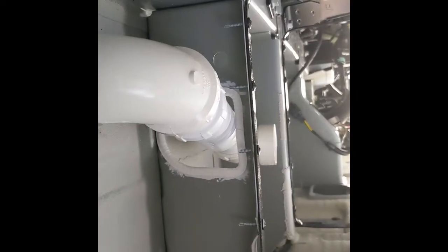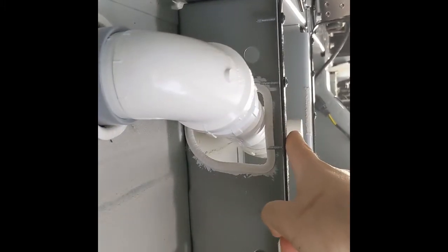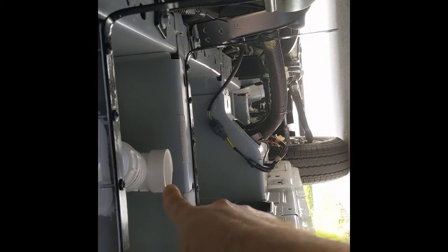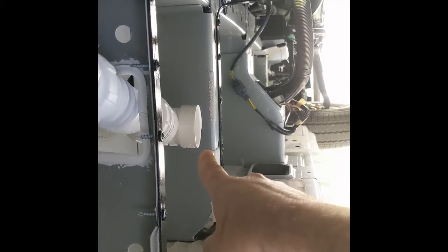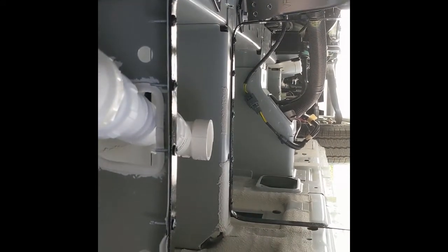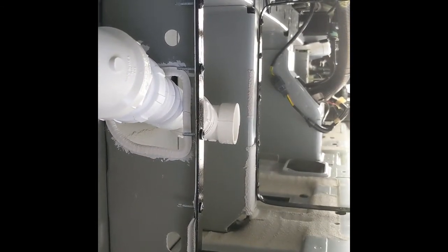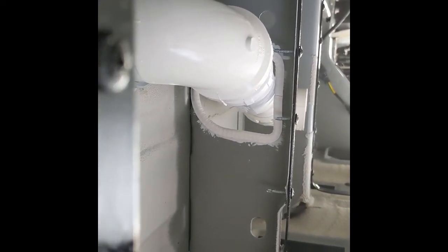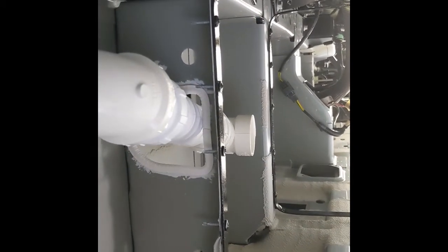You can see that it barely comes down, which is exactly how I want it, because the water tank comes just about right where this is. So I'm just going to use a very short piece of 1.5 inch PVC schedule 40 in there to go to our rubber gasket that I ordered on Amazon, that's going to go into the water tank, which I'll show you in upcoming videos. But it's just perfect. And if not, I can even cut this end in half if I need to, if the margins aren't right.